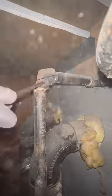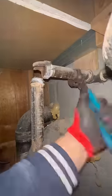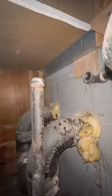The best way to fix it was by cutting the fitting with the grinder. This is very important — make sure you don't cut the threads that you will use again. You just make an opening big enough to fit a chisel inside.